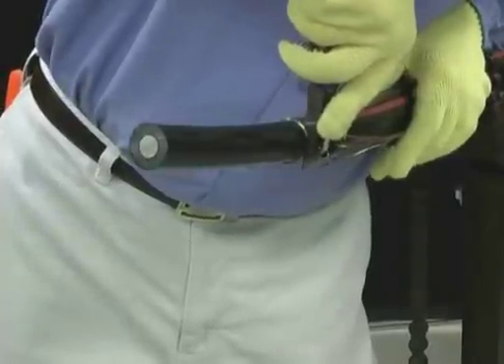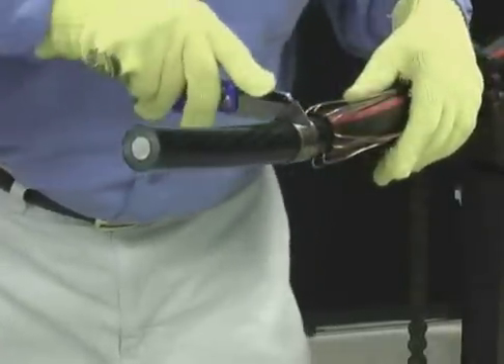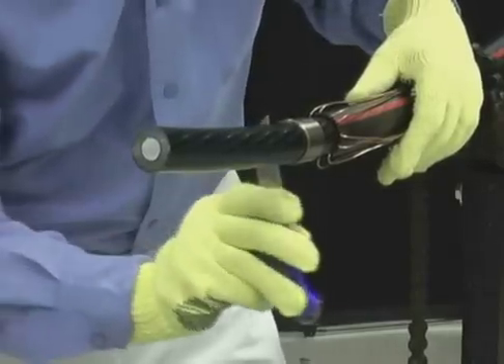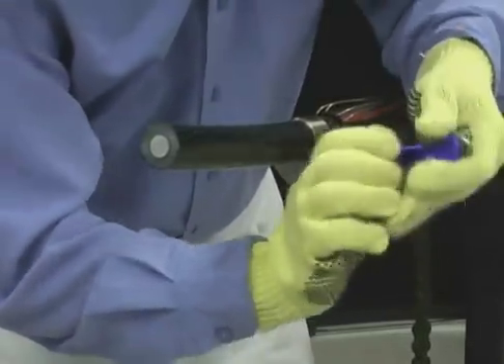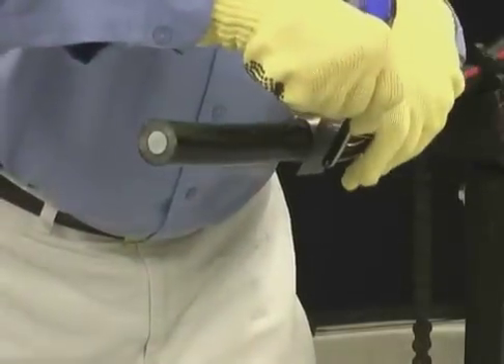Make a ring cut with your knife, being sure to only score the semi-con and not cut all the way through the semi-con layer. Try to make a clean square cut. A knife cut that's too deep at the semi-con cutback cannot be sanded out later on and it will cause a failure.